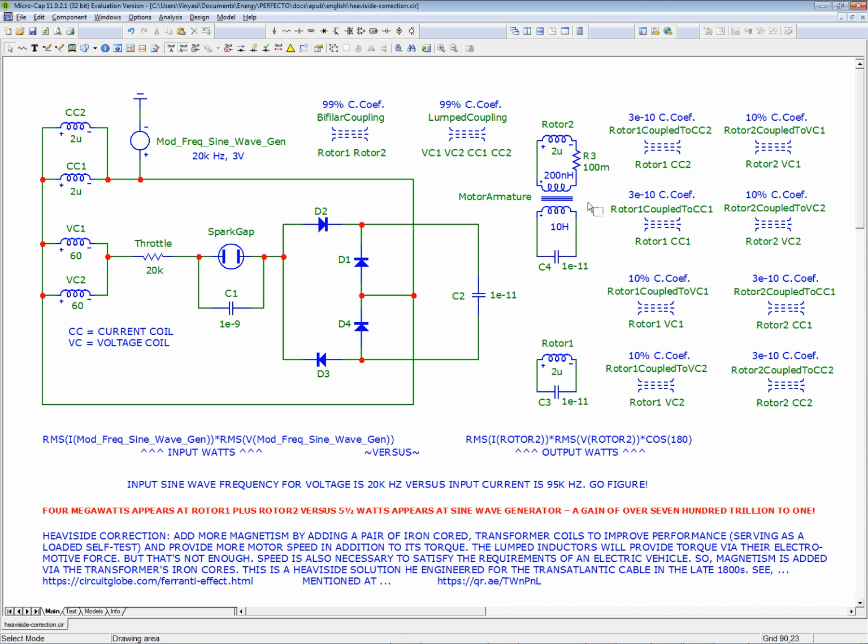Now, it may be reacting still during the course of that half cycle to the change that happened at the beginning of each half cycle, but that's a different matter. The point is, the current is behaving as DC during the half cycle. And so you have to look at it both ways when you do an analysis. You have to look at it both as an AC point of reference as well as a DC analysis in order to get the full benefit of what you're trying to study. It's good to point that out.